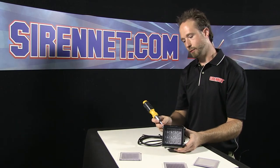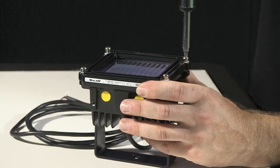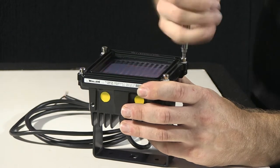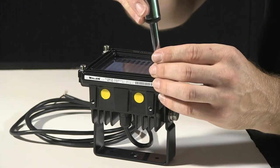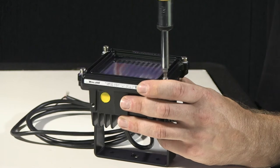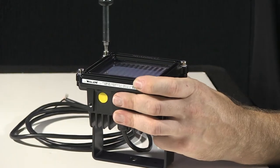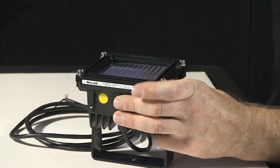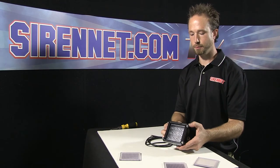And when I redo screws on units with gaskets, I like to do them kind of like if you're doing the lug nut tightening on your car. Basically doing them in a cross action, so that way your gasket here, or basically your pressure, is going to secure equally all the way across. Micro Pioneer, face has all been re-cinched down.